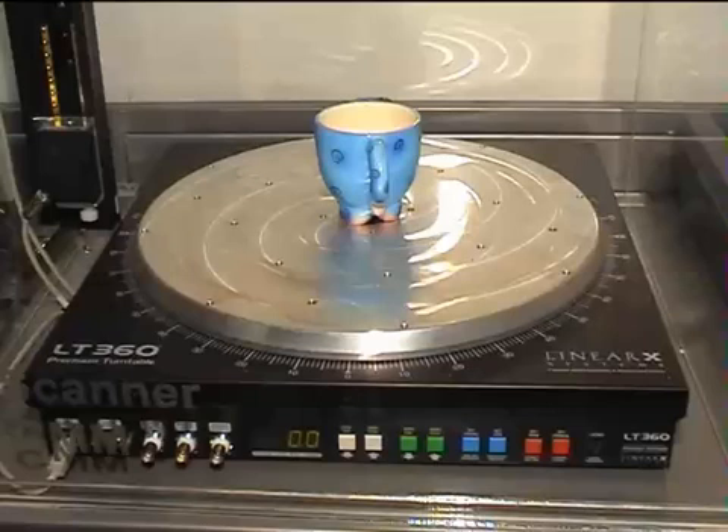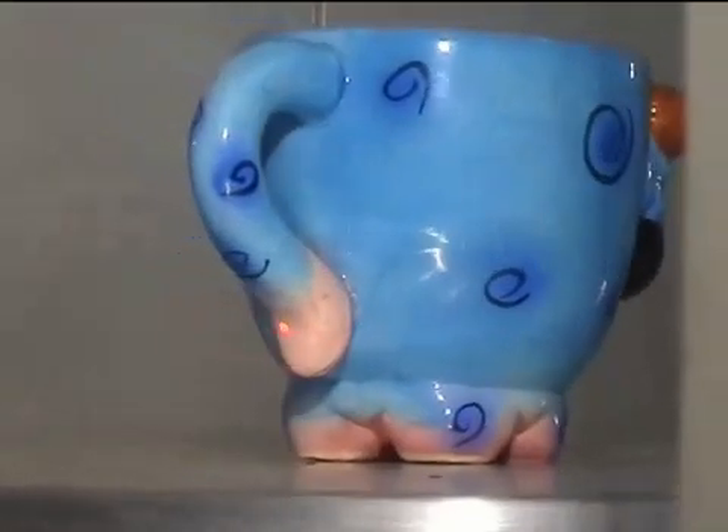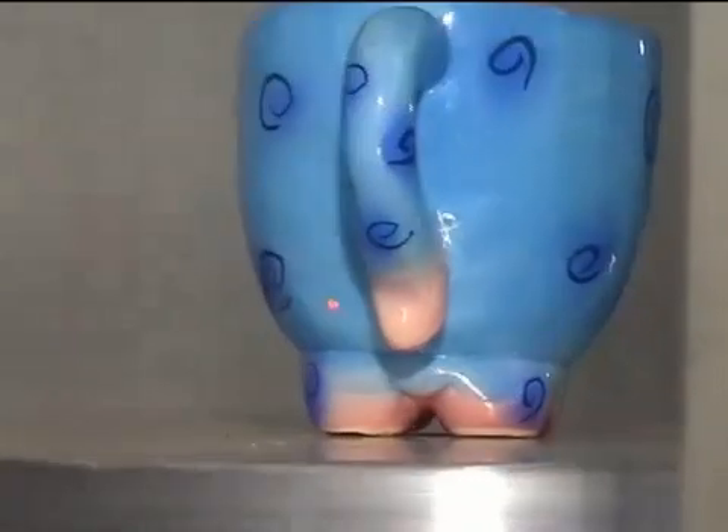The purpose of this Coordinate Measuring Machine is to scan an object and be able to get all of the surface coordinates of the object and enter them into a mesh and a three-dimensional model. The purpose of Coordinate Measuring Machines in general, and of this one in particular, is to carry out reverse engineering on a component and to carry out quality control and check that an object is in accordance with the manufacturing requirements.